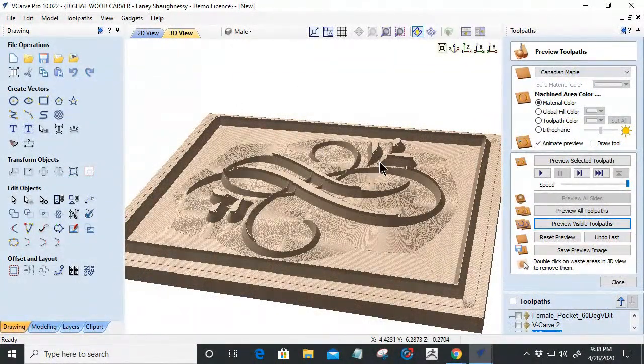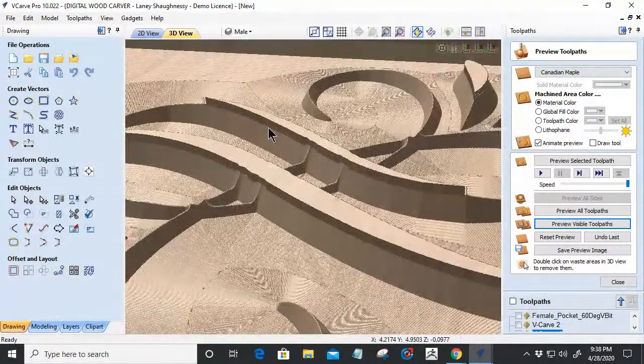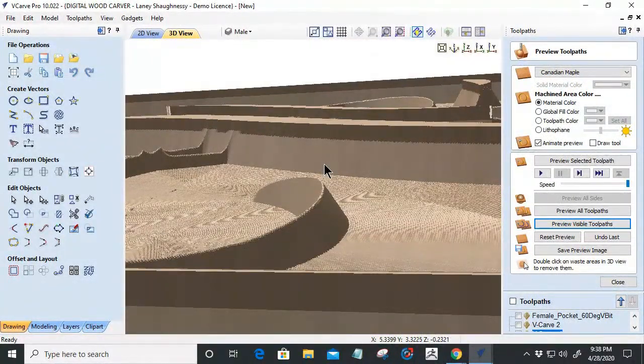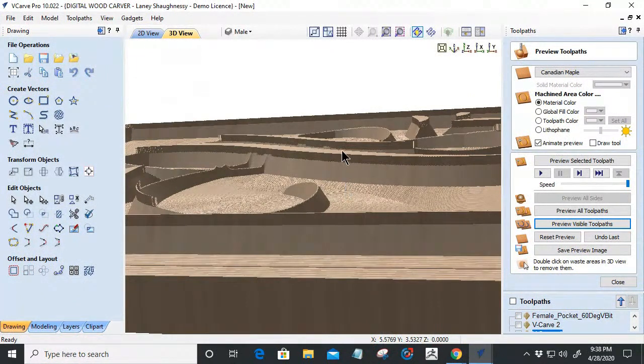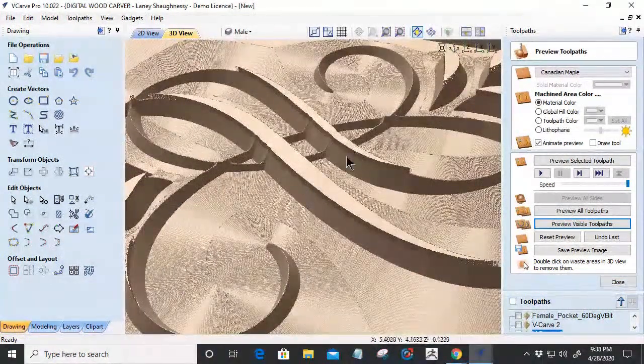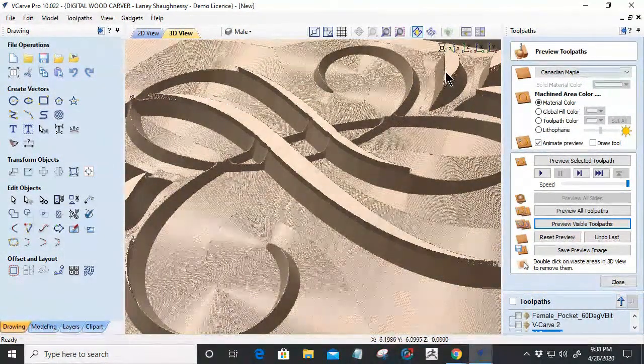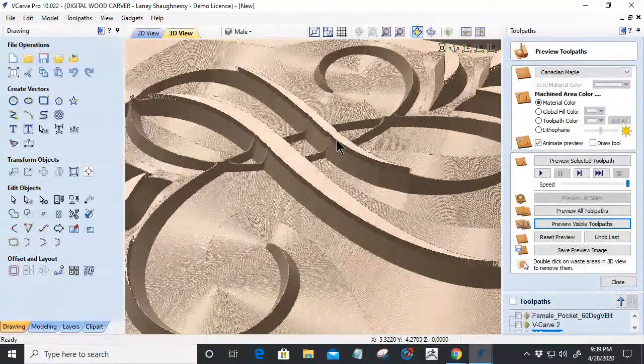All right. Now, if we look at our parts here, what do we have on the top of our parts? Let me get you back into full view here. We have all that straight wood that was beyond the cutter's cutting depth, that's not V-cut, and that straight lip of wood is not fitting into my female V. I can't even get down to these parts that are V because they're shallower, skinnier, but my bigger parts, that part's not going to fit in. Can't fit a square peg into a V-shaped hole. You know what I mean?